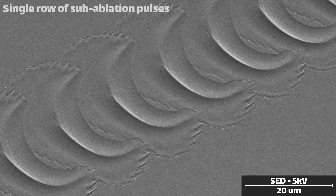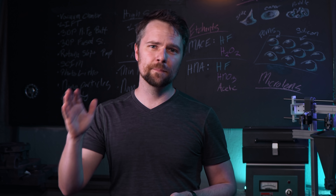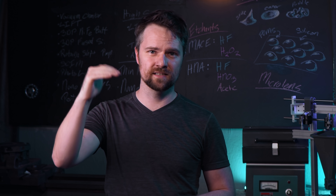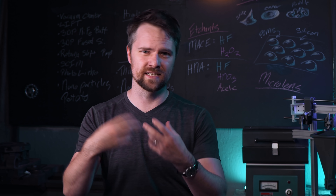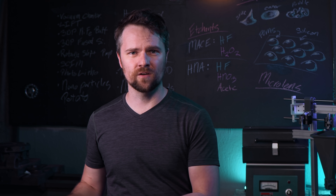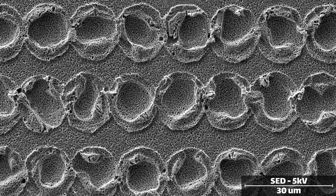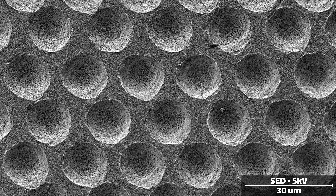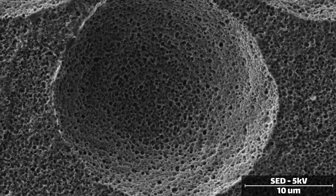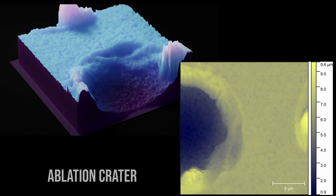This experiment was more complicated to set up — essentially we want silver to be only where the laser strikes, but nowhere else. I ended up spinning a thin layer of photoresist onto the silicon wafer and exposing it, so now we have the whole surface masked off. On top of that we put a thin layer of silver — silicon, photoresist, silver. Then we run the laser ablation, which should ablate through the silver and photoresist and mix it all up. Then we strip the photoresist off using solvents, removing any silver not incorporated into the silicon. And we saw very confusing results — a very porous silicon structure everywhere, both on the ablation craters as well as everywhere else that doesn't have any silver at all.